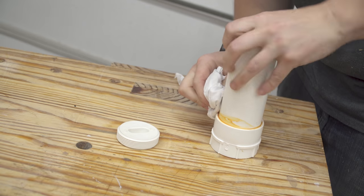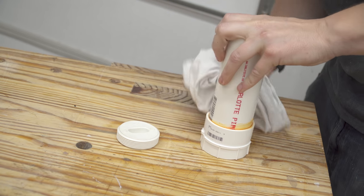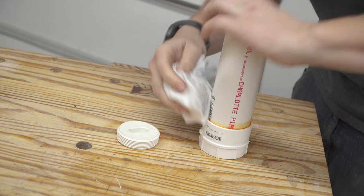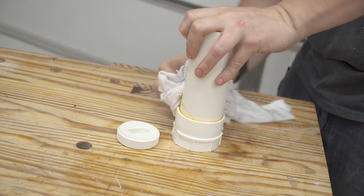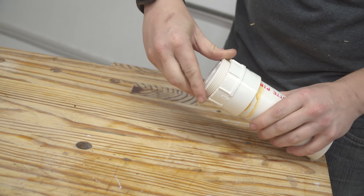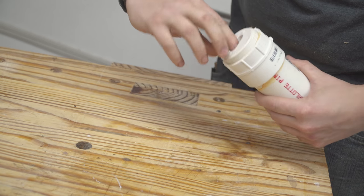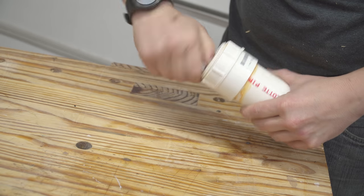It would be extremely difficult to clean out of the bottom of my vacuum chamber after it hardened, so I decided to make a small cylindrical mold out of some two-inch PVC pipe and a coupler and cap — just to make it so I didn't have to worry about cleaning up a lot of the wood hardener resin out of my vacuum chamber.